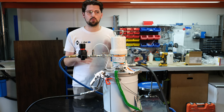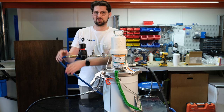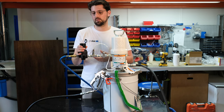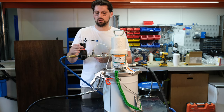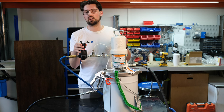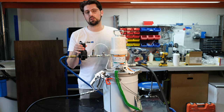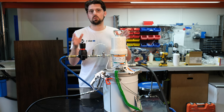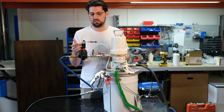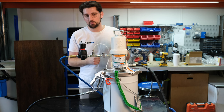So let's get some air through this compressor — we'll build up to pressure and show you what this looks like in use. We have sufficient airflow coming in from our compressor now, and we're going to introduce some air into the system. Pop the pressure dial up to adjust it. The pump will only have a stroke in a 10 to 1 ratio, so 100 psi of air in gives you a thousand psi of pressure out — that's all you'll need for the majority of spraying. Here, I'm going to adjust it to about 60 psi of air pressure in, so it's operating at about 600 psi.